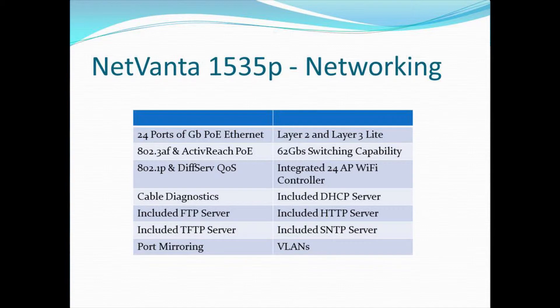With the wireless access point controller functionality, you could create your SSIDs or change policy on all of those APs through a centralized interface, which is great. The AdTran NetVanta 1535P also includes a cabling diagnostics facility where you're able to zero in on a particular port and run a cable diagnostic that will give you important information such as cable length, whether it's wired correctly, or if it's just broken — potentially avoiding an on-site visit for cabling-related problems.